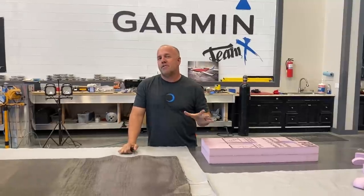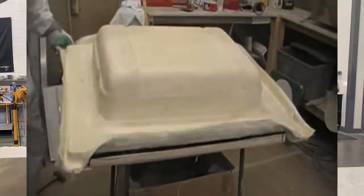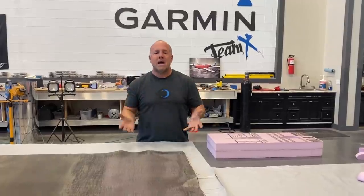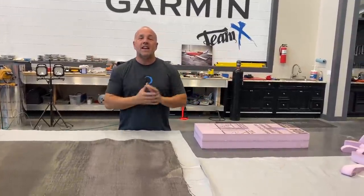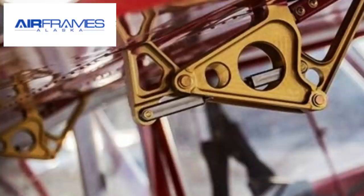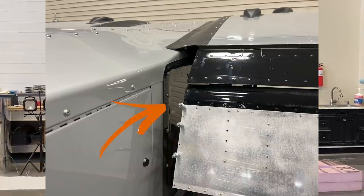Okay guys, we're going to do something a little different in this video. A lot of people have asked how can I make a carbon fiber part as cheap as possible if I only want to make one of them? In mass production carbon fiber, you might end up spending thousands of dollars to custom machine a billet chunk of aluminum or a composite fiberglass resin-based mold and then vacuum bag to it. That makes the strongest mass-produced carbon fiber part you can build, but not everyone wants to build 500 pieces. So we're going to make a couple parts I need for Scrappy - a filler gap on my flaps, my double-slotted Fowler flaps from Airframes Alaska, which I absolutely love. I set the flaps up to hold away from the fuselage because I didn't know how I was going to trim the window, how the taper would be, and I want to make a filler piece to close the gap between the edge of the flap and the side of the fuselage.